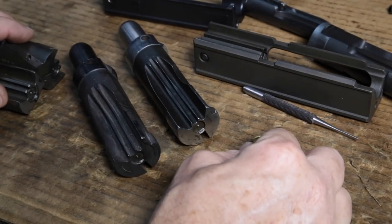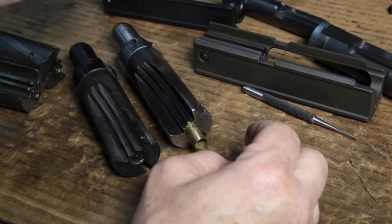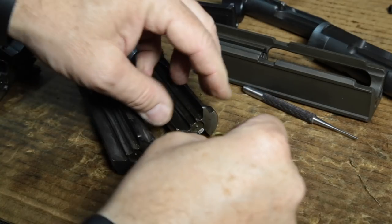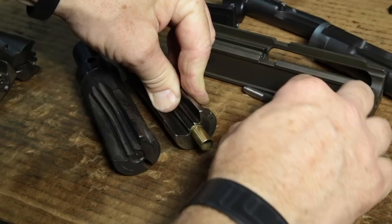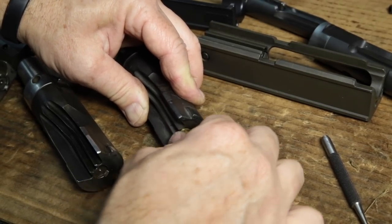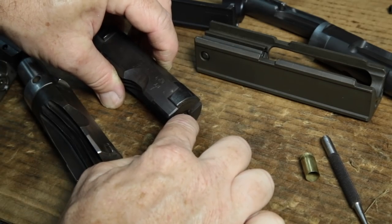How could I do this without using a Sten bolt for a comparison? Here are a couple of Sten bolts. This is what I was playing with when I first started out. Sten parts kits were like between $10 and $30, dirt cheap, and there are literally millions of them out there. A very basic World War II submachine gun, very cheap to make. It snaps in easily. Once it's in there you can't get that out — the extractor does its job very well. Here's the second one, same deal, very hard to get that out of there. The pivot point is right in line with that, so you don't have a tendency to want to unhook this by force placed on the extractor hook.